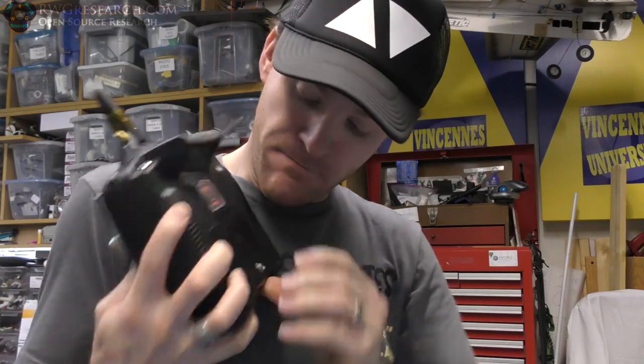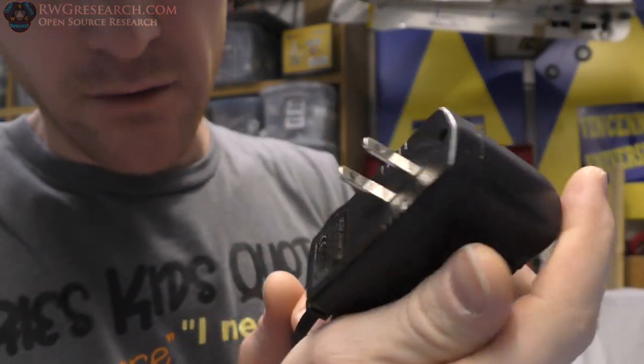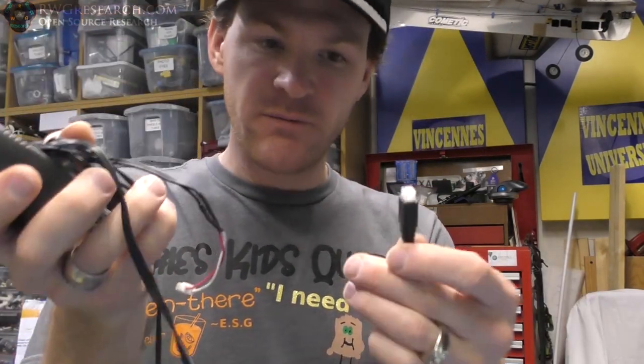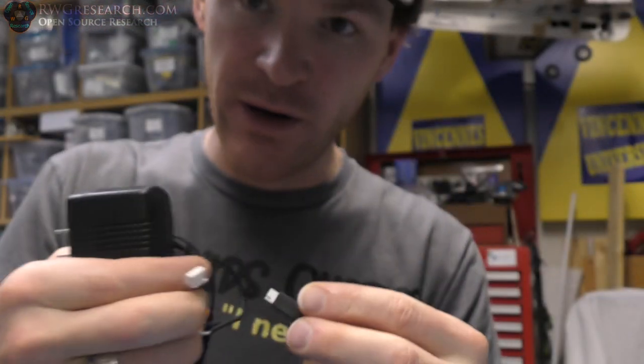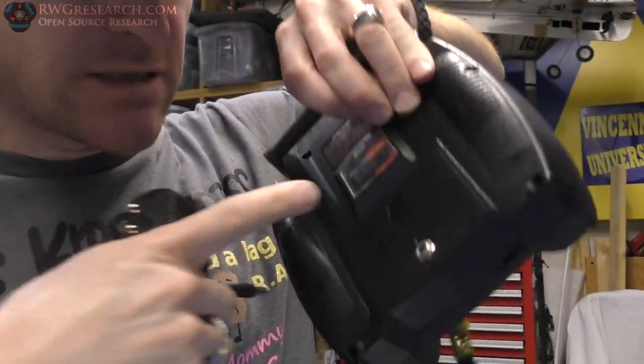Long story short, I was able to use this battery charger, which is designed for a lithium battery — an actual lithium battery charger. It's got a little light on the front that lights up red when it's charging, green when it's not. I put a regular plug on it. It's got a balance lead — it's a three-wire rig. You've got to balance these LiPos and lithium ions. I put a banana jack so I can plug it in. Now I can charge this radio because I have a balancer inside and this is a charger for a lithium battery.